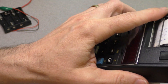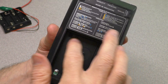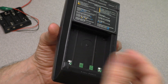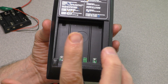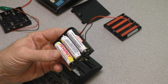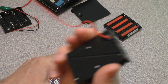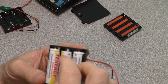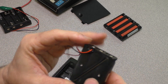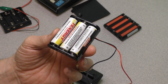This is quite complicated, and I'm not sure I'm going to solve it. There are lots of suggestions online for putting battery packs in these old calculators. For the HP 35, it works fine. For the HP 10, you need something special. So I'm going to start with the HP 35 because it's easier — I'm going to try to modify this holder, take out some springs and probes that are in the way, and see if I can get it to fit properly.